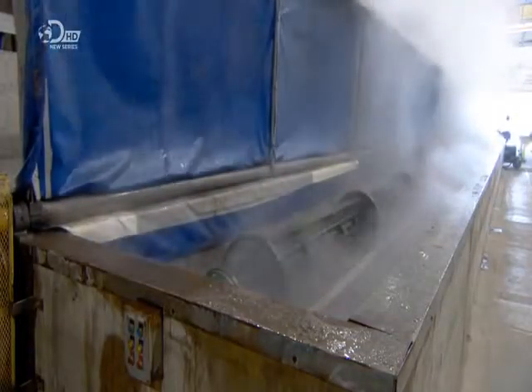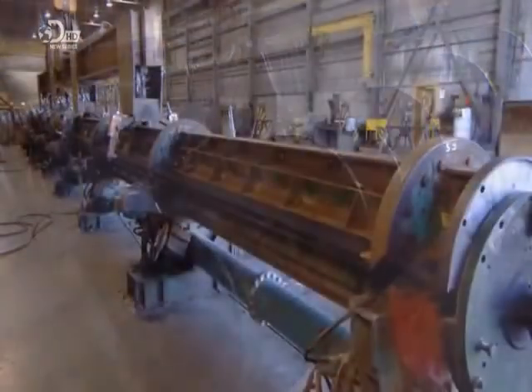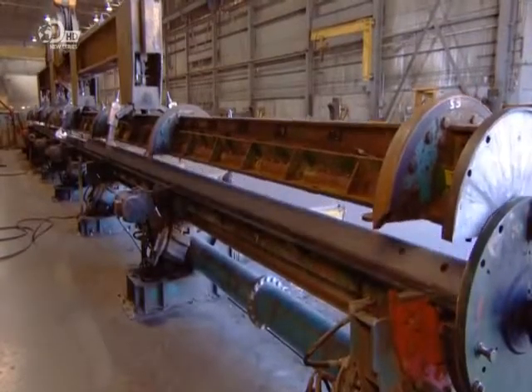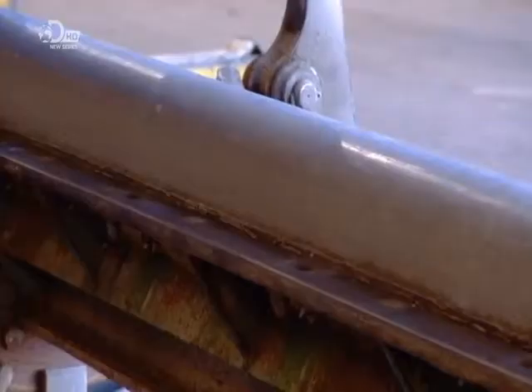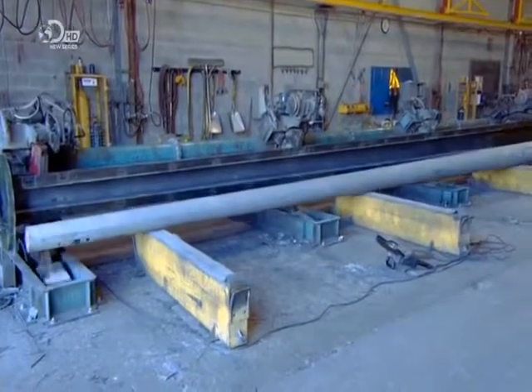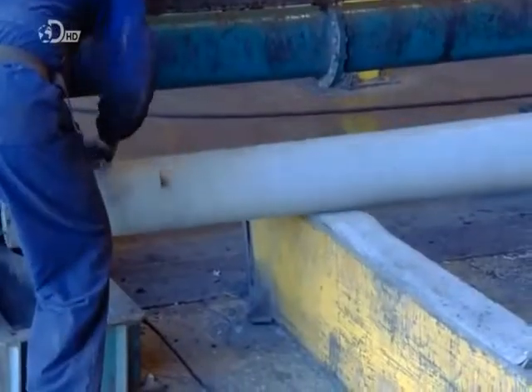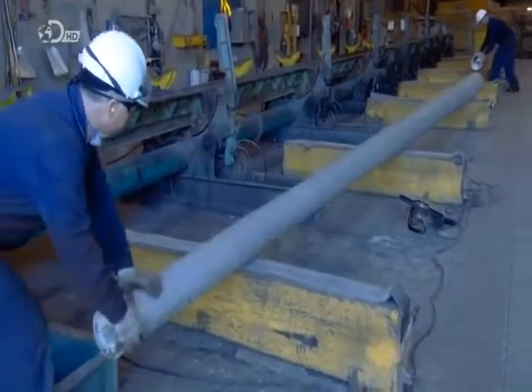Transferred to a kiln, the concrete steam cures in the mould for about five hours. The concrete lampposts are ready for the big reveal. They open the mould and roll them out. At this point the two posts are still attached. They examine them for flaws and then they'll separate them. All they need now is some buffing up.